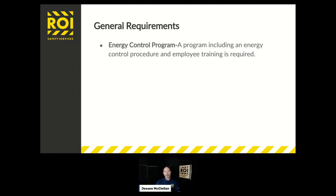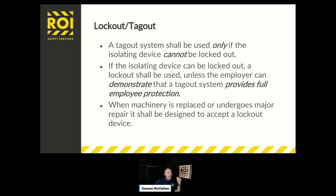I just did a company down in Corona in the food industry, and they had over 30 pieces of equipment. Each piece of equipment had 3 to 4 different lockout tagout scenarios, and it was very complicated, and it took several days to get it done right. But they got it done, and it does take time. Now you only really need to do that once for the equipment, and then evaluate it annually, and then do your training and update your training annually, and make sure all your systems are working. And new hires and transfers, those are all things you need to do training on.